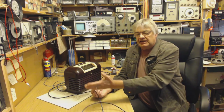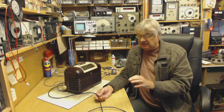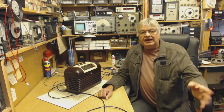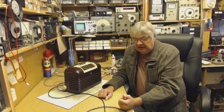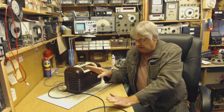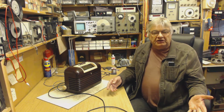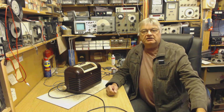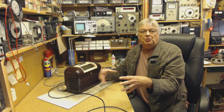So what is this earth connection then? It's a grounded Marconi aerial. If you see what I mean, in effect, that's what it is. You've got from your chassis, your 60 odd feet of wiring, through your house and wherever, eventually down to earth. A proper earth in the ground. That, although it's a brilliant electrical safety earth, low resistance path and all that, as far as RF is concerned, it's not. It's an aerial, if you see what I mean. So, any interference around, this earth will pick up. Your chassis will be kind of swamped with interference, if you like.